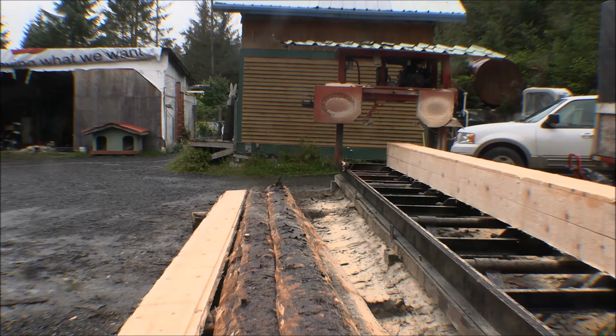So anyway, I've got the new blades on there. I've got my first blade on there. What have I made? I've cut four logs with it, I guess. Five logs now. Well, I'm going to change it out after this log, and it's still cutting all right, but it's got a flat tooth that's a flyer on it or something. When it goes through those knots, it gets some pretty rough cut on it, but it's cutting good, cutting straight, and it cut that log. But like I said, I think now it's time to retire it and put a new blade on there.